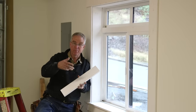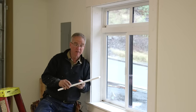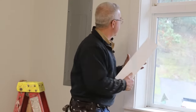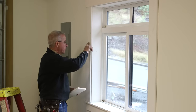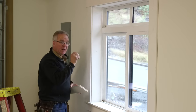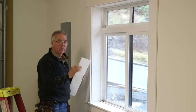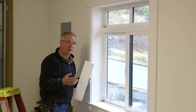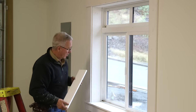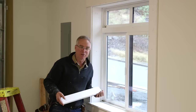There was another alternative for the moldings — MDF, medium density fiberboard. It comes in all sorts of profiles and looks about like this, but it's not the same. With pine, you put it up, nail it, and there's a nice crisp hole to fill and sand and cover. With MDF, you nail it and a little volcano pimples up that has to be sanded or scraped off, reprimed, and dapped — and you can always find it. Over time you can tell it was MDF. There's just something about putting up a piece of wood molding that makes me feel like a carpenter, and I'm glad to be able to do it.